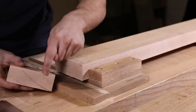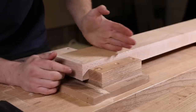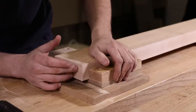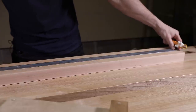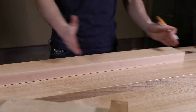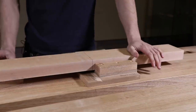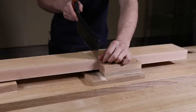We're through. So we've removed the really bad split from the end of this component, but there still looks like a tiny one here — that's the split that continues all the way along the edge. I could keep cutting to remove all the smaller splits further along, but if I'm too fussy about it this chopping board will only be able to cut like a grape. That crack is relatively small, so I'm going to live with it. Now we're going to cut this bit of beech in half — at the moment it's 860 millimeters, so cut it to 430, and that's going to be the overall size of our chopping board. I'll square a line across the top and down the edges. This time I'm going to go directly on the line rather than to one side, because there is no waste side here.